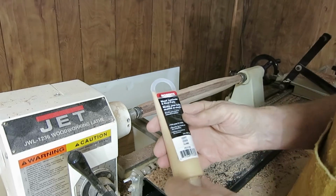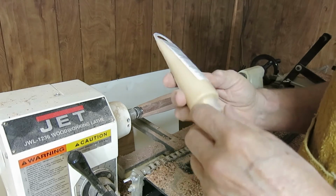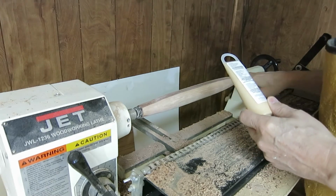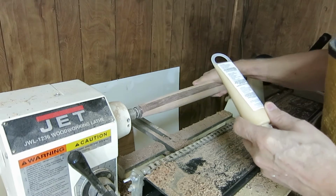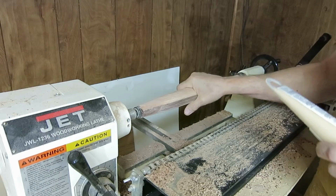Okay, this is my Roberts wood, laminate, and vinyl putty. And as you can see, I'm using light. That's because of the oak. I'm not really worried about it coloring the walnut, because the walnut is such tight grain. I don't have to worry about it. But I really think the oak needs to fill the grain. You know, keep foodstuffs out of there.